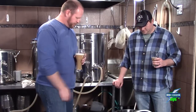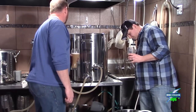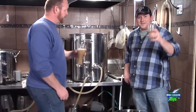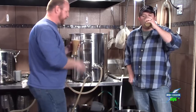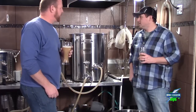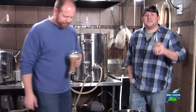Build day was a success! We're doing a wet test on the hot liquor tank now — it's got probably 20 gallons or more in it. We're doing the wet test on the boil kettle too. We did it — cheers, guys! Nice to be done. There's still a little bit left — the panel wiring, lots of spaghetti. But 174 degrees will be coming to a boil soon. With a 4,500-watt element it'll be a long brew day, but it's electric so you can walk away. Alright guys, see ya — cheers!